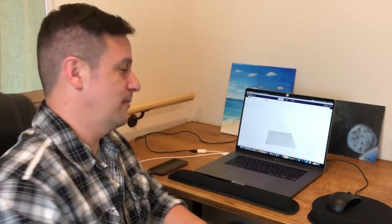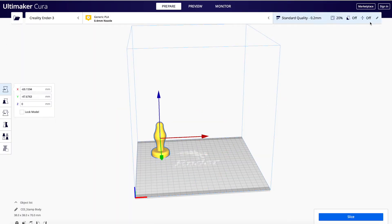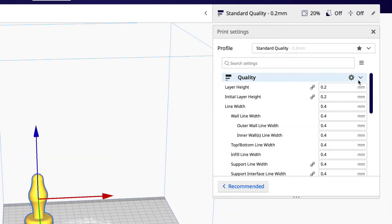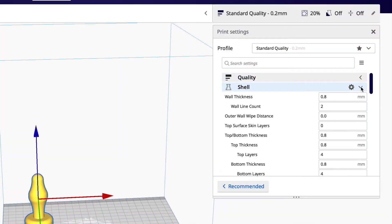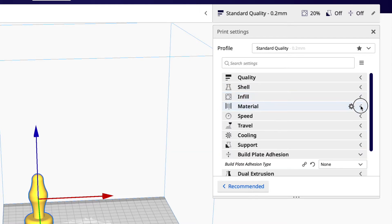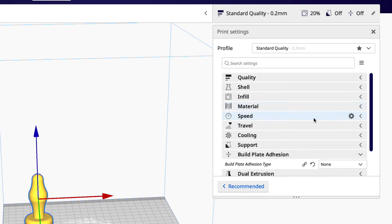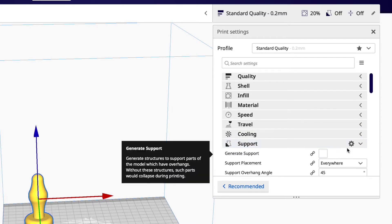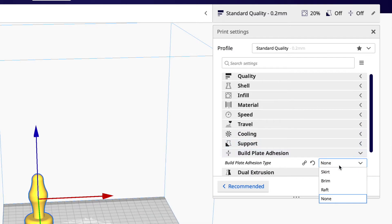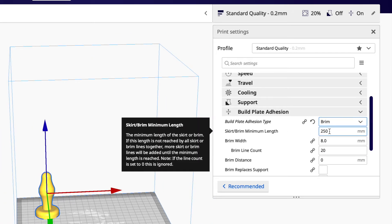So let's go do that. The reason I use millimeters while designing instead of inches is because whenever I transfer over to Cura, it seems to scale down my model. Now I'm just making sure all my settings are right. Temperature is pretty important. We're using PETG for the print of this part, so you see me there just checking the temperature. We don't need supports, but for bed adhesion because it's so tall, I'm going to add a brim — pretty small brim.